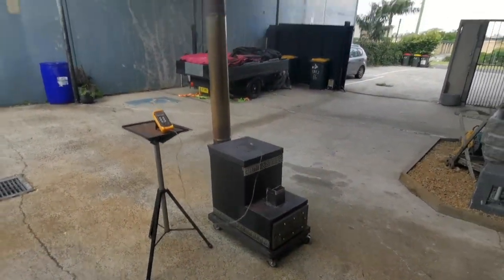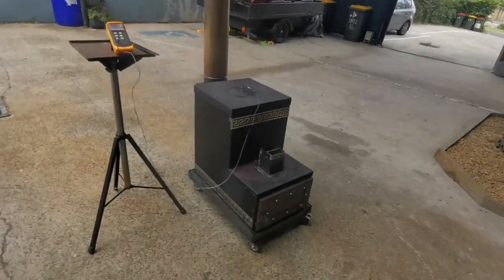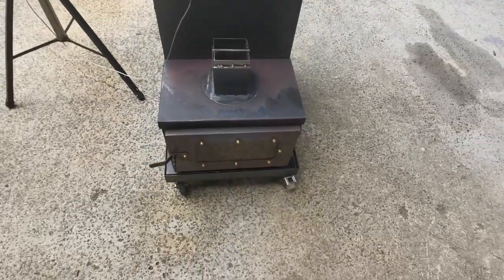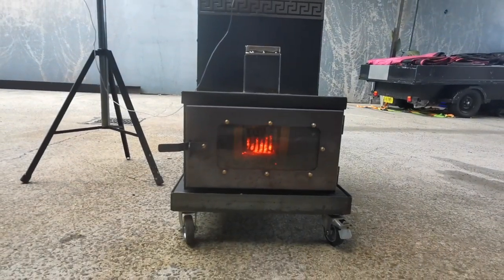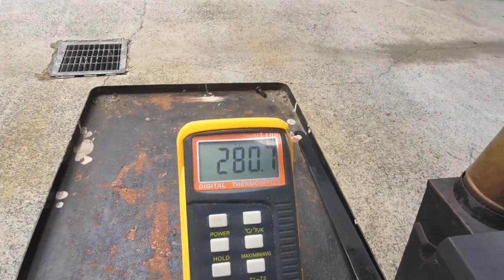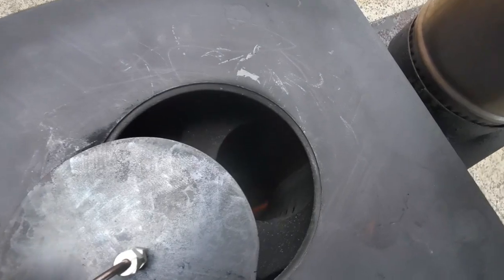In terms of a steady stable burn, it's running super clean. This is the Eco 2 — it's probably about a kilo of pellets over half an hour, or less than a kilo over half an hour. It's definitely a very stable burn. We've got a steady close to 300 at the top point here — not as hot as it can be with wood, but probably hot enough.